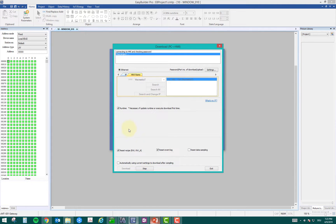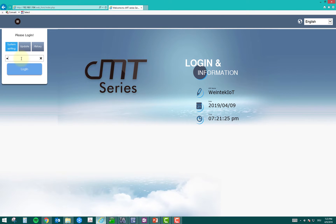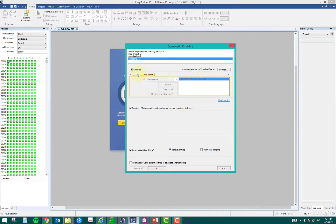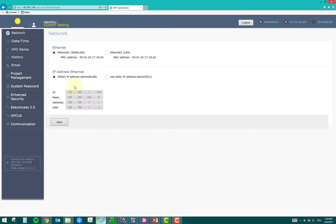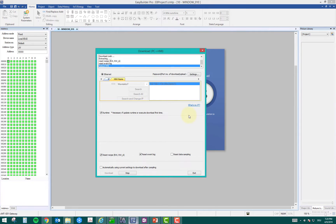In the meantime, we can open the IoT device's web interface and check the configuration inside. I open the IP address of my IoT device, enter the password, and click login. I check the status — it's still downloading. We can see the tags we defined in EasyBuilder Pro are visible in the web interface. Once the download is finished, we go to OPC UA. It says unavailable because it's still downloading, and now it's rebooting. Now the project download is finished.